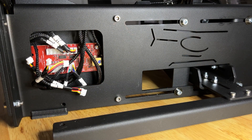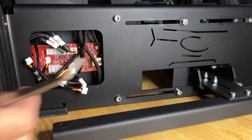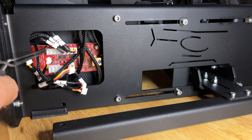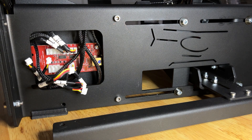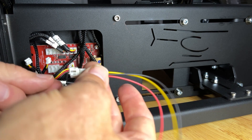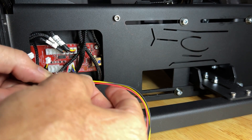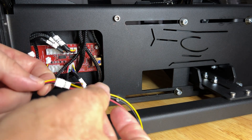The next step is to complete the build of your Puma X exactly like the directions say. All the wiring is very clearly labeled — from the factory each cable is labeled, so cable D, C, number 1, and every place they plug in corresponds to a labeled location on the circuit board. They did a great job with this. What we're going to do is utilize some of these cables — not all of them — to wire up to our CAT6 cable going back to our radio. The problem is that the JST connectors ordered from Amazon have slightly different color coding than the Puma's stock harness, so I'm going to show you how to fix that to keep everything consistent.